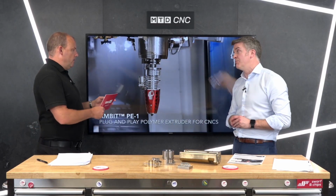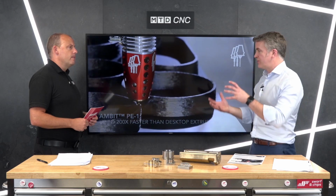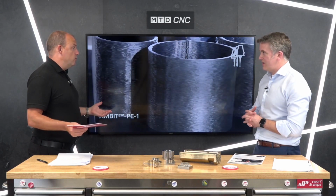What about the setting time though, the print and, you know, how? Well, there isn't much. If you're printing onto a plate, for example, you're ready, you're straight onto the plate. If you're having to machine off the back, then by rights, once you've turned it over, quick skim on the back and you're off and running again. And I suppose the beauty of this then is that you could then come in with your end mill and machine a superior finish or recreate the part. Total flexibility, isn't it? It's mixing subtractive and additive with a lower cost.